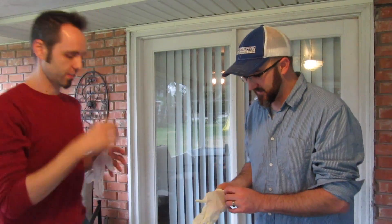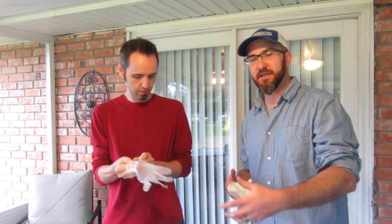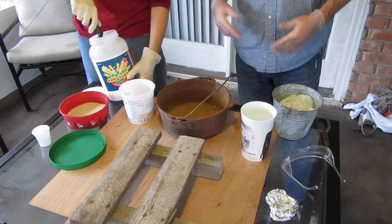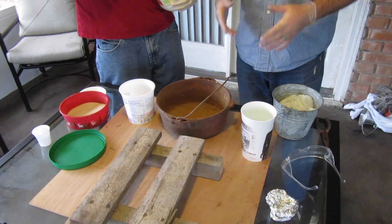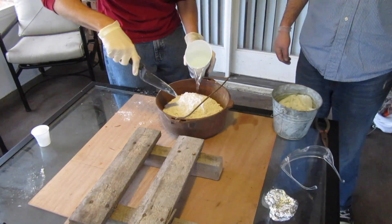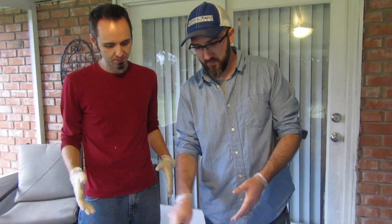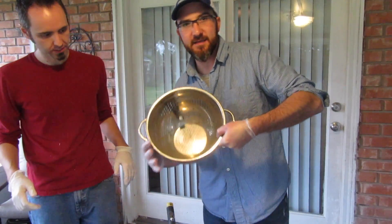The plaster is caustic and it will actually put a burn on your hand. You can feel it'll get really hot as it begins to mix with the water — there's a chemical reaction that happens. So safety first this time. So now we're gonna pour and stir. We only have a handful of minutes to work with the plaster. We want it to be about like cement — yeah, kind of like cement. We're gonna pack it inside here.